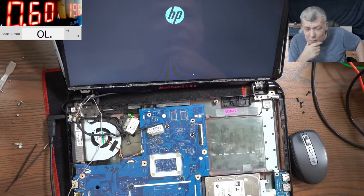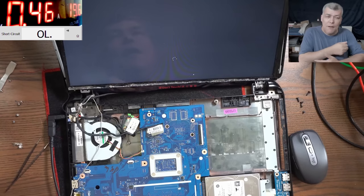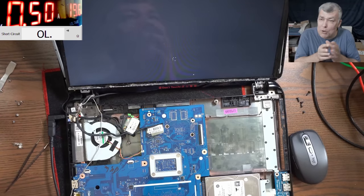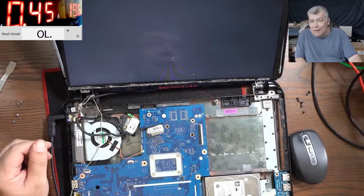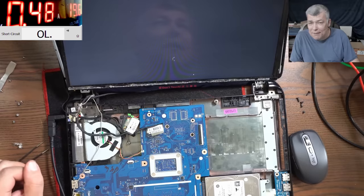That's crazy. And we don't even know which wire is the problem there. I mean, the wire is not interrupted. I don't try to make the point. This kind of fault is not from an interrupted wire. This fault is from a shorted wire to ground. And you will not usually see something like that. You will see broken wires. That's what you will see.